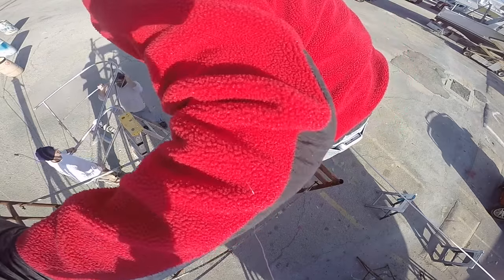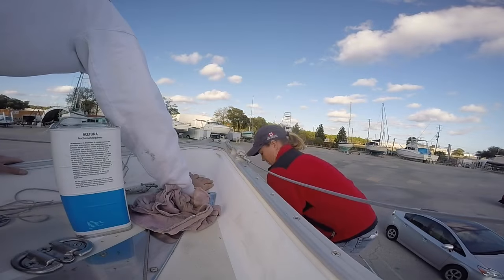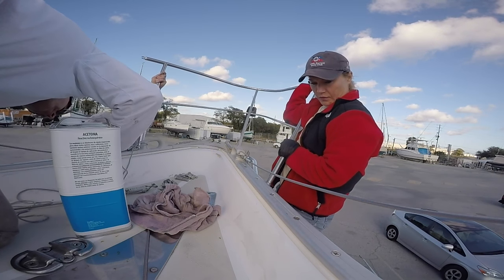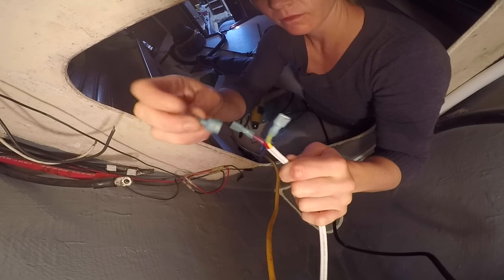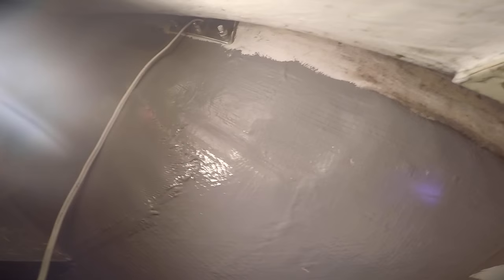Re-bed number one. Now listen, Video Annie — this is important, the wire needs to be fed in. Phillip was working down below to get the backing plates on and feed the wire through. Not an easy chore. But once we got it pulled through and wired up, we would be in business. We are reconnecting the nav light, doing a new plug-and-play here. That's our nav light that goes up in the bow pulpit, so as we're running we're red and green.